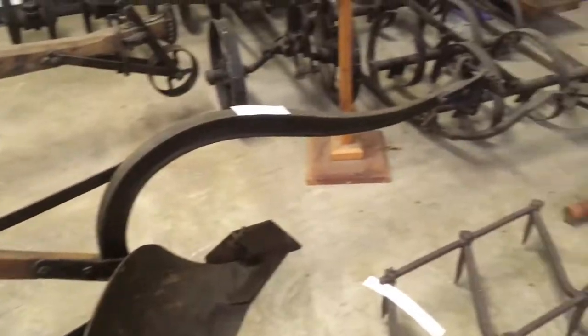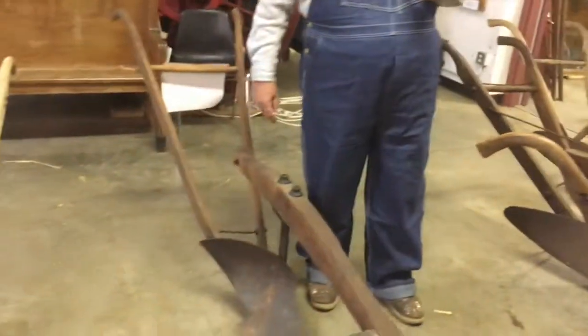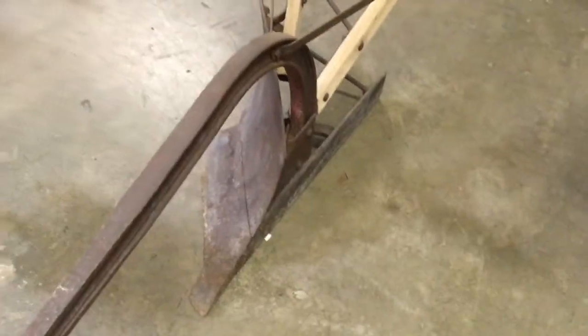These other plows would sometimes have a rolling coulter on them for that very same purpose, to cut the corn stalks or the stubble grain to get it buried so it would decompose for the next year's crop. The plow lays would be taken to a blacksmith shop to be resharpened. They'd wear down on the point and the side, and they'd heat them up, and then they would hammer them out until they got back to the shape so you could plow.